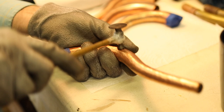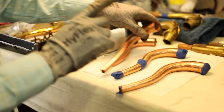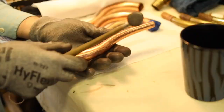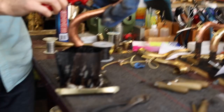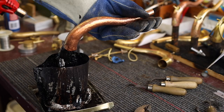The other thing that happens once you compact the metal is it becomes stiffer and actually changes the sound of the neck — you gain more brilliance and the neck is quicker responding. Once the tube is formed, it's filled with something called pitch — tar and wax — which is hard at room temperature. With the hardened pitch inside the neck, Kim can safely hammer the outside, making the neck stronger and more responsive. Once the 8,000 or so taps are done, the pitch is heated up inside the neck until it all slides out.